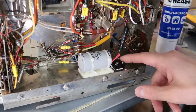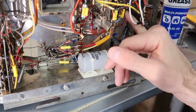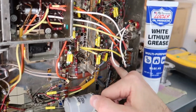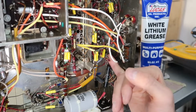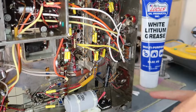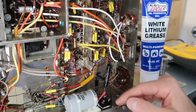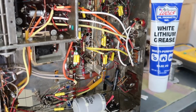But alright, it's done. So there should be a second stage to the capacitor. It looks like they're still using the original capacitor. It's still connected. And I don't like that because I've actually seen these old capacitors fail to a short. And so having the original capacitor still in the circuit is quite a risk. I'm tempted to take it out of the circuit. It's a 3-section capacitor, which is really a pain to unwire. I guess we got lucky maybe and this one dried out and so it's not arcing, and maybe it never will. But we should boost the capacitance across those terminals because they're probably not doing so well. And that just means adding some simple capacitors to ground at a couple hundred volts rating. So we'll probably do that.